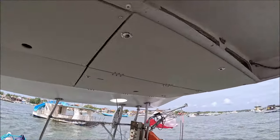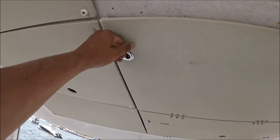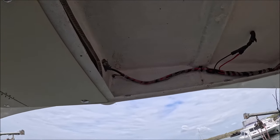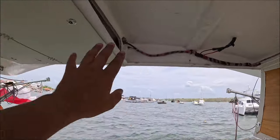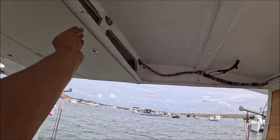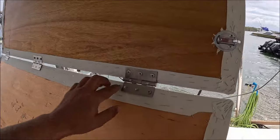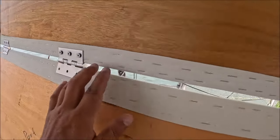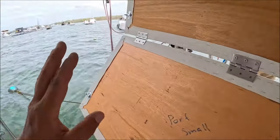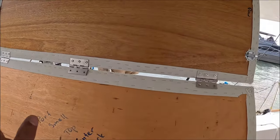Here's the first half all set — all the hinges are working, just need a little cleaning. Everything is in place. The only issue is if we close this side it's off by about 3mm, so there's a very tight gap. I'll switch the hinges to free up a couple of millimeters. If needed I'll do the same with this panel, and then let's try to get all this aligned.